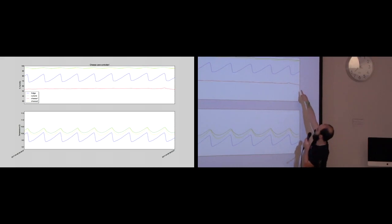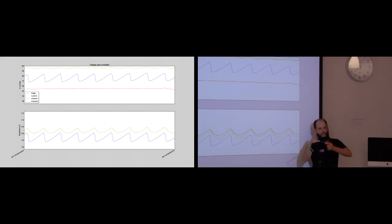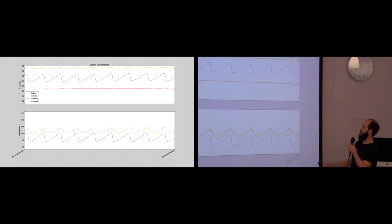And that blue one you see is my reference temperature in the fridge. The ones up top are inside the Tupperware container. So that's a reason to have them in a container. It stabilizes, even if it's cracked open a little bit, the humidity doesn't go crazy. Whenever the fridge turns on the compressor, it gets cold, all the water condenses on it, so the humidity drops. And when it turns off, the water evaporates again, and it creates all sorts of swings. I don't think it scares the cheese, because on average the humidity is fine, but I just wanted to look at that.